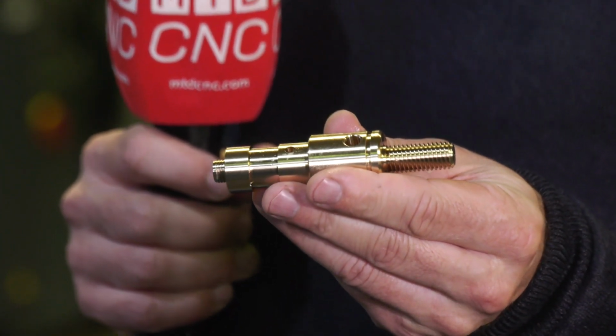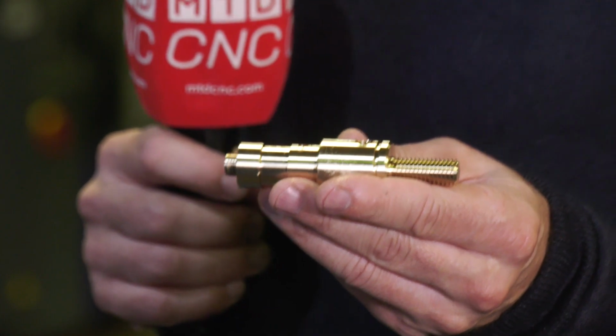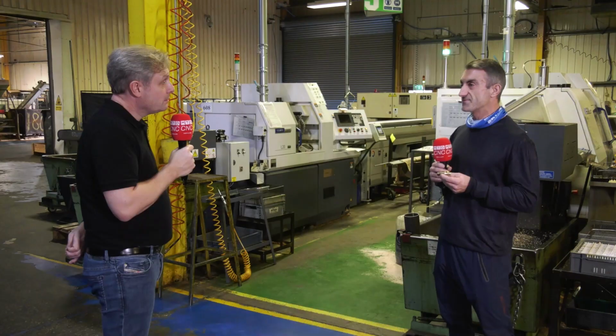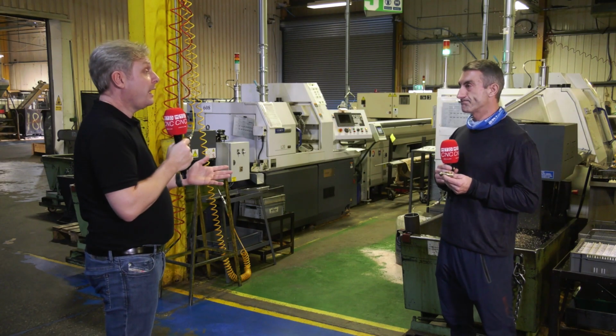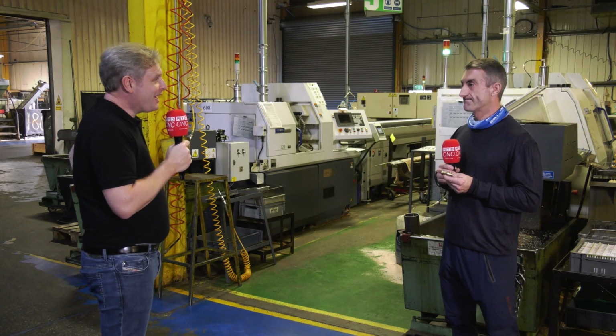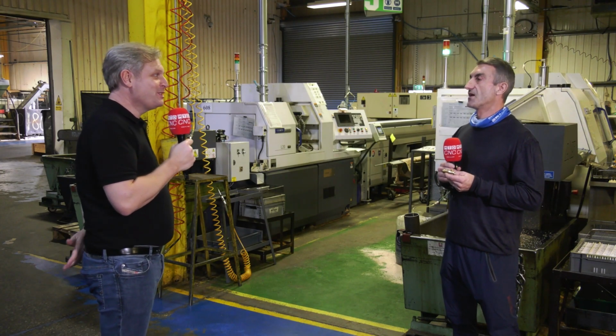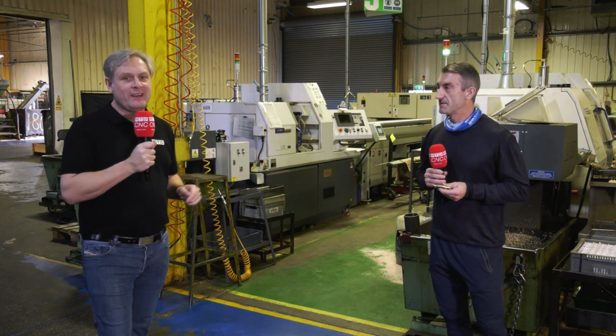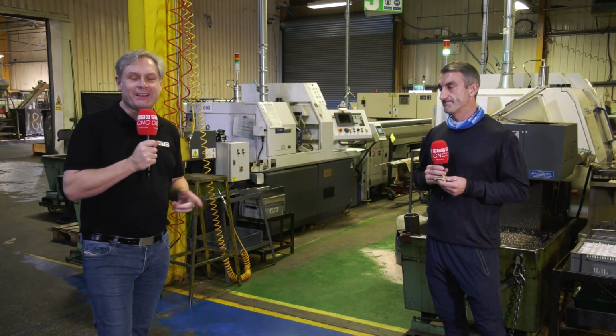But you're doing all sorts of materials on these machines. Yeah, we do everything from duplex to 316 to brass to copper to nylon. We do everything. Even the plastics, not a problem with the LFV? Not at all. Brilliant. So big fans of Citizen, Miyanos and the Cincom machines? Yes, 100% big fans. There you go, great example of slide head technology at Bryken Precision Engineering up in Liverpool.